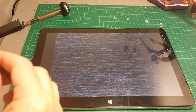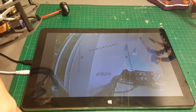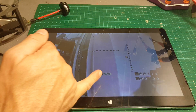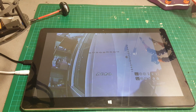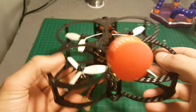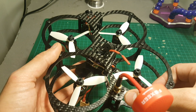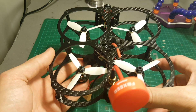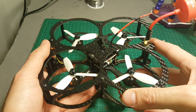When you connect the battery you get the Betaflight OSD. From the menu you can change the frequency and the VTX strength. You can see the flight mode, uptime, flight time, and voltage on top. It's cropped here due to the aspect ratio, but on my FatShark goggles it worked perfectly. Having the Betaflight OSD is a great feature and you can configure everything inside Betaflight. I'll put a link to the Sirin FPV website — they did a great job explaining how it works. The only thing left is to take it for a test flight. I hope you enjoyed this video — see you in my next videos, goodbye!